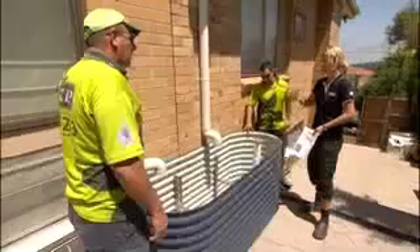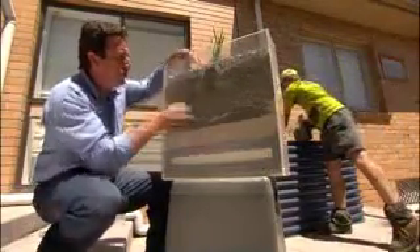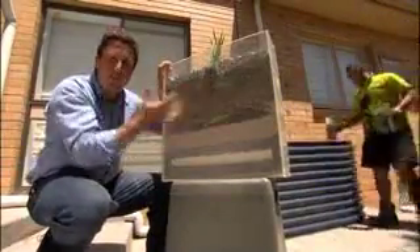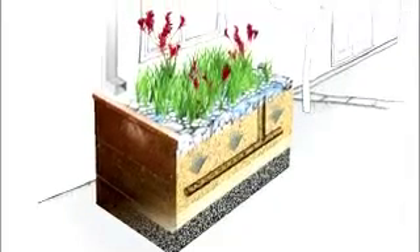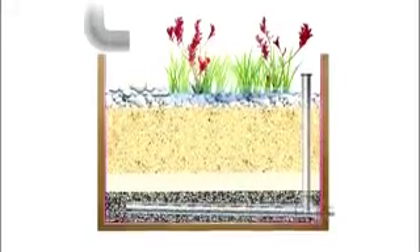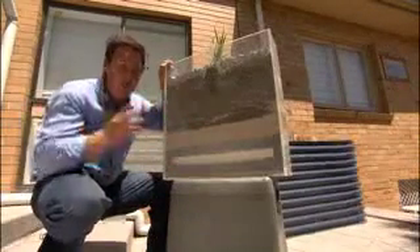Once the piping has been put in place running from the rainwater tank into the planter box, it's time for the soil profile. We've got the gravel across the top and we've got a Dianella in the middle. The rain comes down through the gravel, goes down through the roots of the Dianella, which is growing in a nice sandy soil medium — sieving nutrients and pollutants out of that water as it goes down. It reaches the sandy level and of course that's another filtration process. Eventually there's gravel at the base and there's a slotted agripipe in here that sends the water back into stormwater. This ends up back in our river system and because it's been through this filtration process, it's good for the rivers.